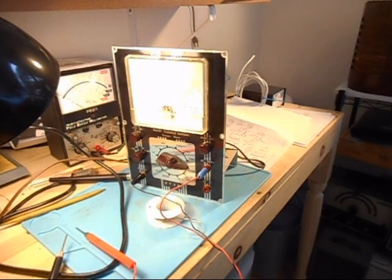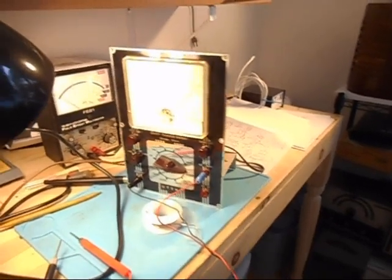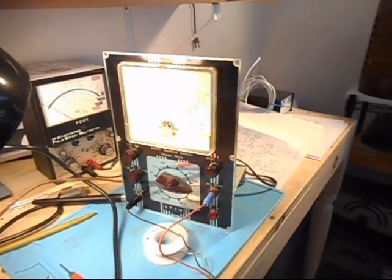And I replaced a 6AL5. It looked like it was weak. That was one problem I had, because it wasn't even moving hardly at all. But the problem is, I think I have a weak 12AU7 tube in there, so I've got to check my stuff. I know I've got a couple. I just have to go and find them, dig them out. But that, and then I'll probably have to replace some of the caps in it. But other than that, I think that's all I'm going to end up doing to it, because it looks nice, if nothing else, even if it doesn't work good.